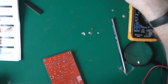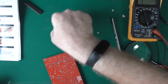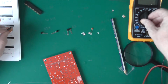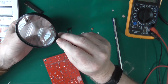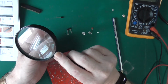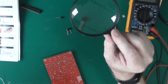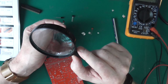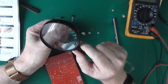transistors, and there's two different ones. Hang on. Oh, that's later. Ignore me. So we have four things that look like transistors, but they're not all transistors. There's two transistors. That is a 9014, so that's Q2. That's a 79. That's a 79L05. Which is Q3. Or U4, they've called it. That's an 8550, so that's Q1, and this should be the 7805. So it's Q1, Q2, U4 and U5.